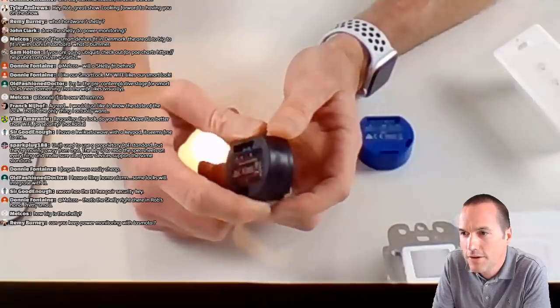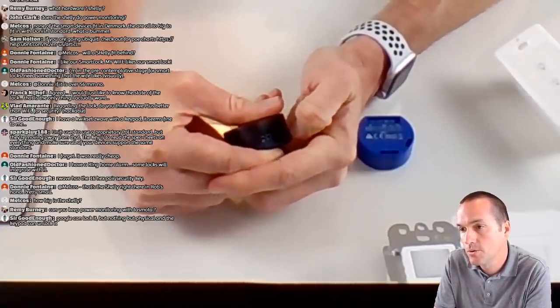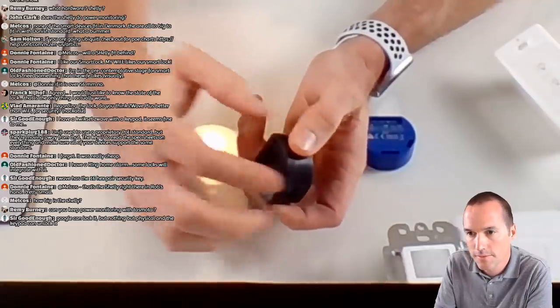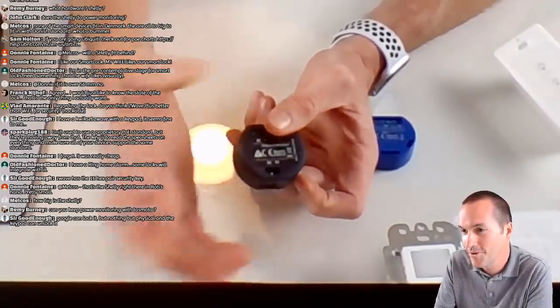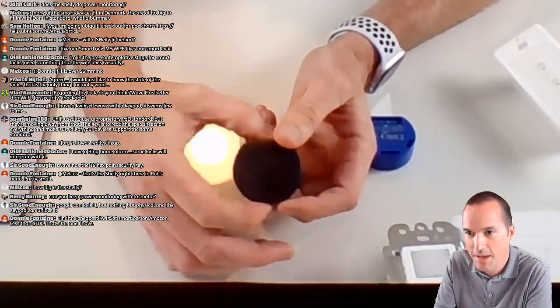Yeah, they're good enough. Have you ever seen all of the Z-Wave hacks? Even if they have a security key, there are ways around that, and they're all related to the fact that Z-Wave wants to have backward compatibility. All of their insecure Z-Wave stuff has to also be able to communicate with all the secure Z-Wave stuff, so you can essentially downgrade attack Z-Wave stuff and make it so that it doesn't even matter if it has the 16 hex pair security key. It doesn't need that, because it needs to be able to communicate with the version 1.0 stuff. When I was doing the interview with Charlton, he showed me a bunch of different Z-Wave and Zigbee hacks.